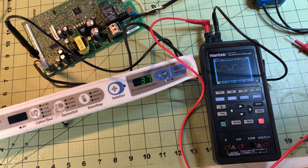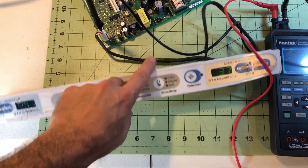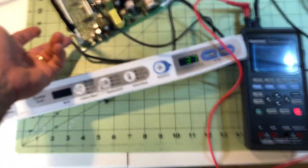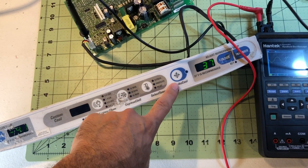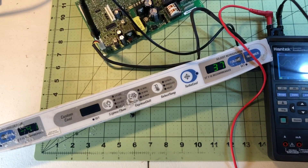As far as uses for it, the main troubleshooting I do is for MCU and CCU communication — so I don't have to guess whether the communication has stopped here or is present there. I can see the data coming in and out. The interface will have communication out to the microprocessor, and the microprocessor communicates back, so it's talking back and forth. If I disconnect the microprocessor and put my leads there, I'll still get the signal going to the interface but not the reply — that's one way to see where communication is stopping.